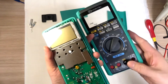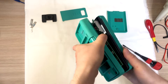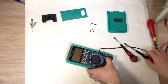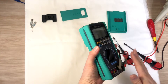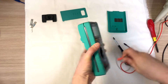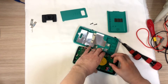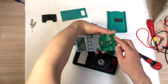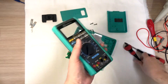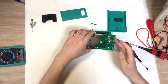The reason I don't like the split-type banana jack is: when dropping the multimeter, most of the time the leads are inserted. When it hits the ground or floor, it's going to hit the back of the leads, and the shock will go to the jack. However, if it's a split type, then it has more possibility to break the plastic surrounding the jack. So if they are going to have a revised or future model, I hope they use the cylinder jack.